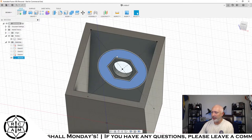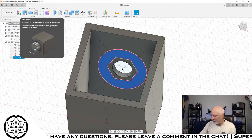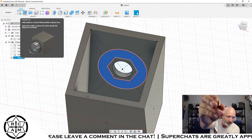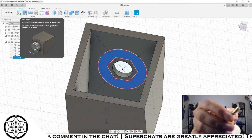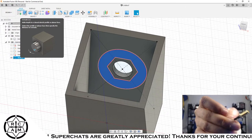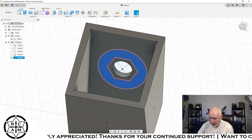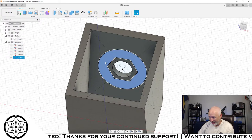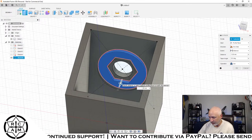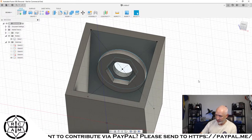Sorry. All right, and we're going to take this and we're going to extrude this in by 2 millimeters, which is the thickness of that little kind of flanged area on the SMA connector. So we're going to extrude that down to create, we're going to go with 2 millimeters.